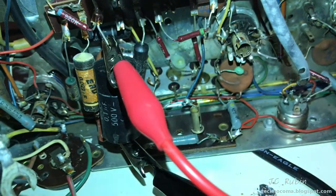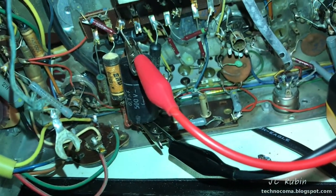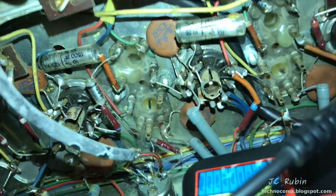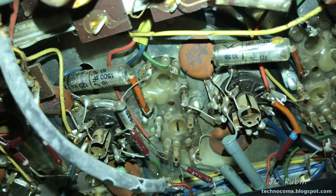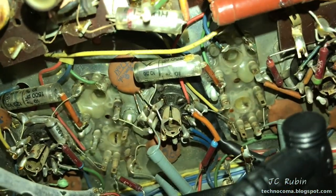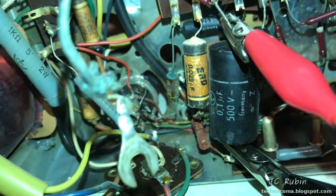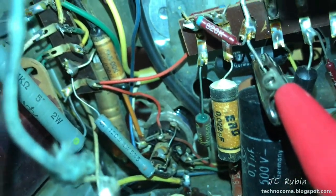Let's take a look at that one — really big 0.1. That one is reading 10.92 ohms, and it's 500 volt rated, so not good. Definitely some capacitor issues. You can see that these are European style, wrapped and sealed in plastic — they're see-through, these picofarad ones. Just wrapped aluminum — those are probably good. But these dry chemical ones, these paper ones, they're probably all bad.